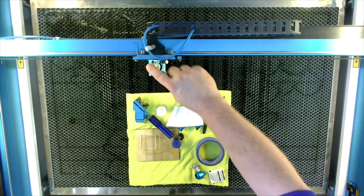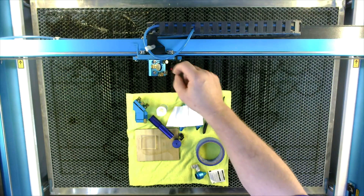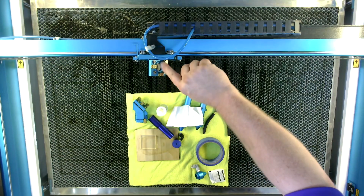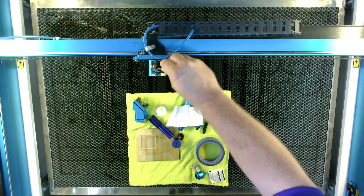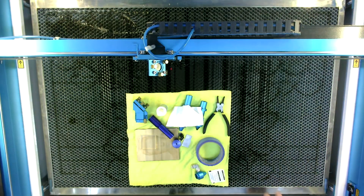As long as you're not too rough with the mirrors, you won't have to do a realignment, as long as all this stuff is set and your backup screws are cinched down good to hold everything in place. There will be a separate video on the actual cleaning of the lenses and mirrors, as well as alignment and some other things.